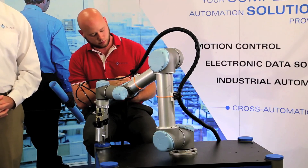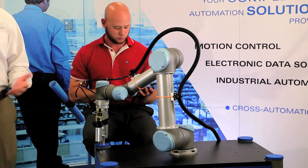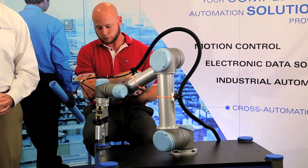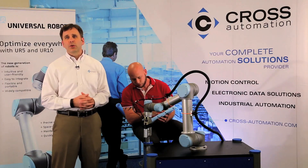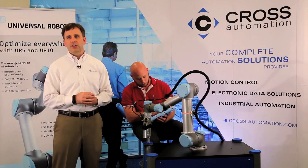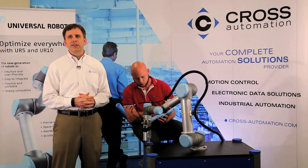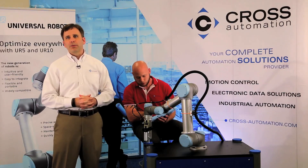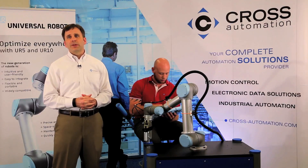For most applications, the programming can be done solely with the interactive teach pendant. UR's PolyScope interface allows you to program the robot to do all the things you would typically expect from an industrial robot — like joint moves, linear moves, process moves, set up variables, create multiple coordinate systems based on application features, even set up fieldbus communications, or use pre-built palletizing wizards. You can even set up multiple programming threads that allow you to monitor I/O or do other machine control while the main robot program is running. And should you ever need it, there's also a very full-featured scripting language.